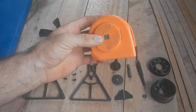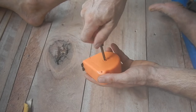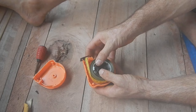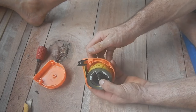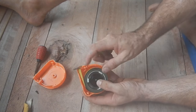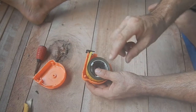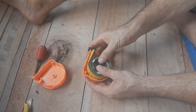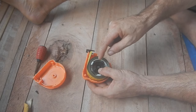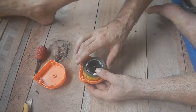We're gonna deal with the tape measure first — we need the spring out of here. I have two different versions of this fan: one for a 22 millimeter wide spring and one for this fat jumbo spring which is almost 30 millimeters wide. We're gonna do the one with the 30 millimeter wide one. This is the first one of these I've done with this size; the only difference between the two versions is just one extra part, and I'll have two different sets of 3D printer files.